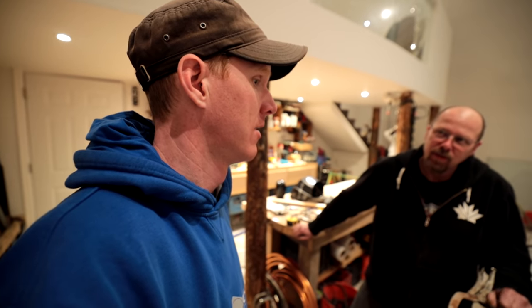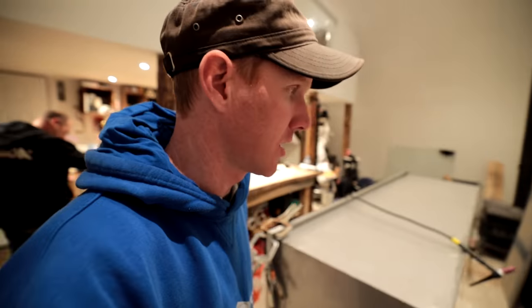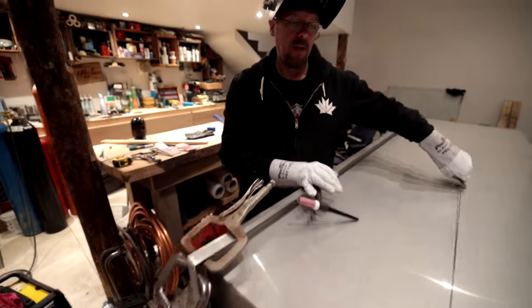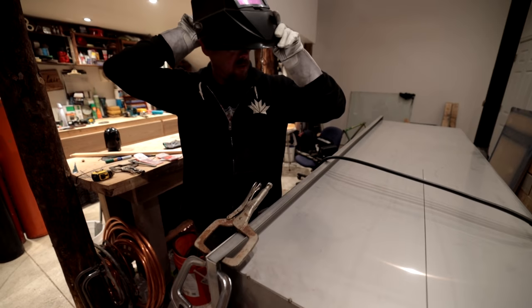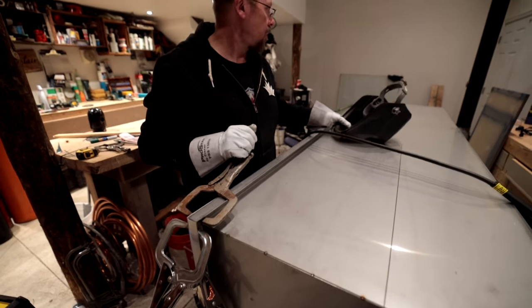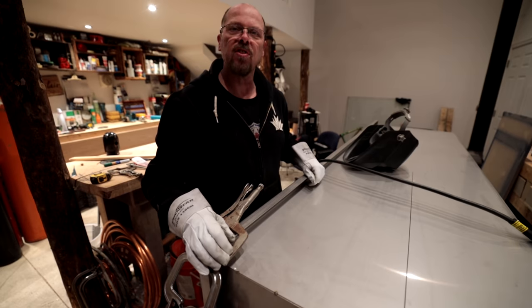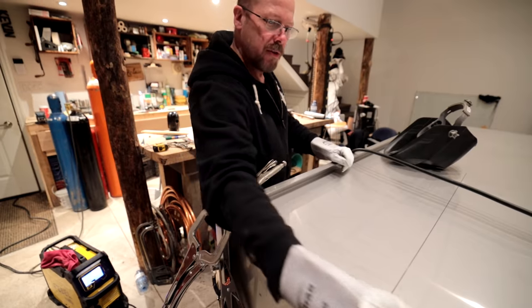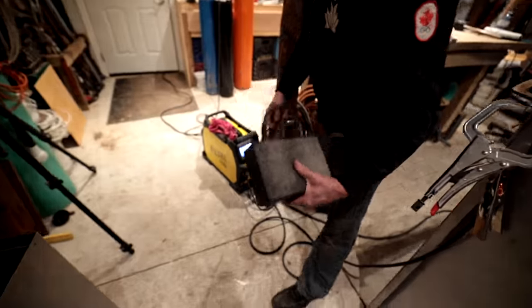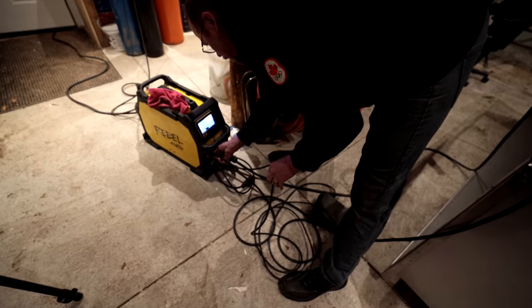Don't forget that you're going to be doing something about it. All right. I got to do the pipes. I want to do the pipes on the heat exchanger because that just seems like I want to do that. So what's the method to the madness of what you're doing next? Should you just button up the entire seams? We've tacked it all at this point. So what are you doing now? Yeah. So we've tacked it all together. We made sure that everything is square and flush and it's not wobbly. So we've tacked it all together in spots, so now we're just going to seam weld it all up, make sure that there's good fusion in there, weld everything up, make sure it's leak tight.